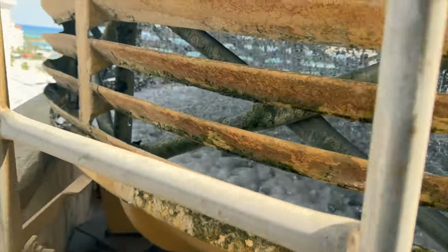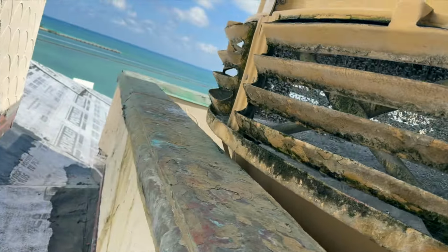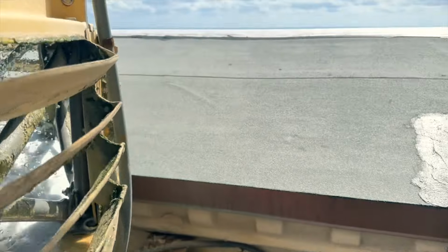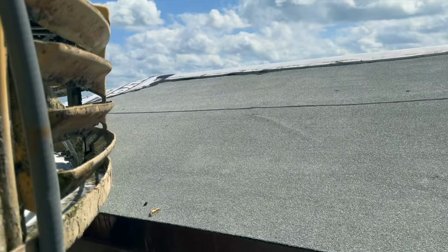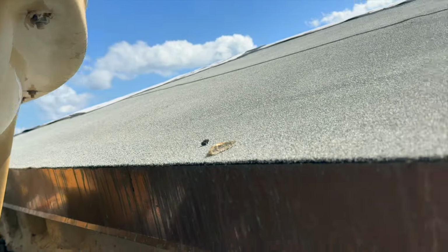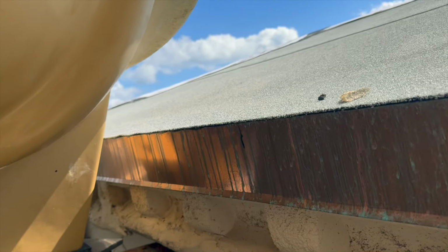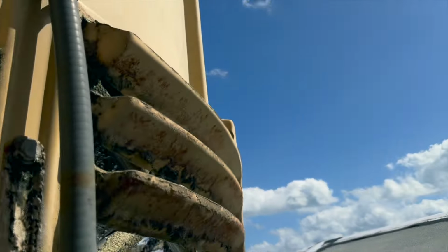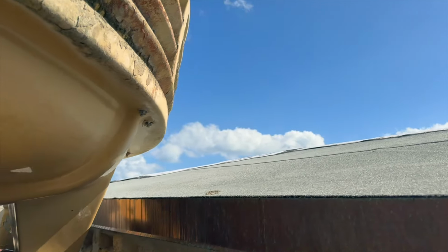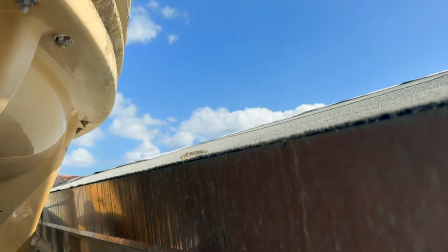We talked about this cooling tower spitting chemicals out, damaging this coping cap here. There's holes in it down on that side. On this side, what we did was we put cap sheet. It should be more moisture resistant than the TU Plus. And you can see this is already patinaing this metal here. But we put cap sheet here to help protect, I guess, from the moisture from the cooling tower on this north side. It was already doing some damage to our paper right here.